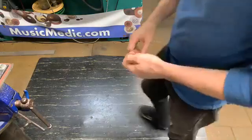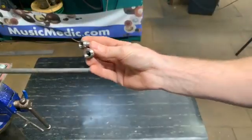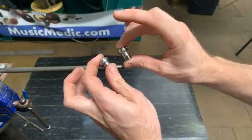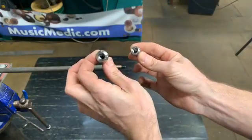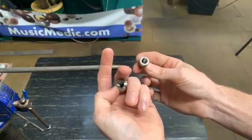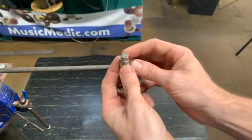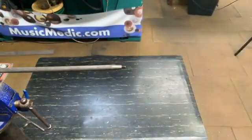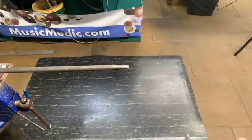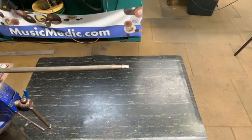What can I do for you, Rich? Why don't we use the 5/8 rod? And I want to show you guys another couple of tools that we have for flute. These are our flute dent barrels, and these come in a diameter for the body and a diameter for the head joint. They have, I think it's 3/8-16 threads for a normal dent mandrel, and they also have this flat machined on there, and you can occasionally, as you're working these tools, if they get stuck on the rod, use a pair of pliers to remove them from the dent rod.